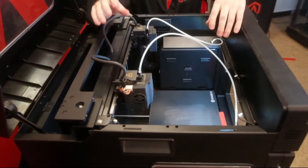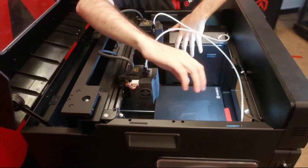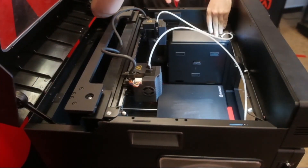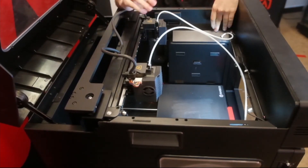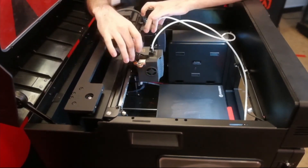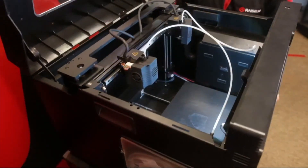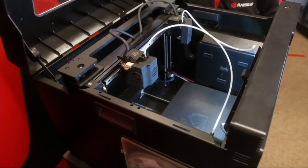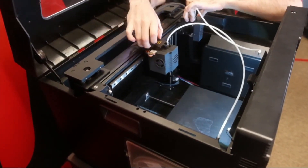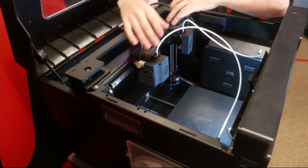Inside the E2, looking at it from above with the top lid open, these two chambers are going to be your filament chambers in the upper section right before the feed tube. It also has an optical filament run-out sensor similar to the Pro Series. The big thing to look at is the IDEX system — the independent dual extruder print heads. These allow the E2 to run prints in duplication and mirror mode, something the Pro 2 is not capable of doing, by either copying the same exact movements to give you two duplicate parts or mirroring the movements to give you two mirrored parts.